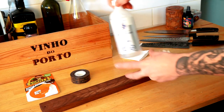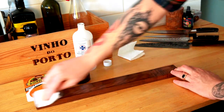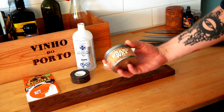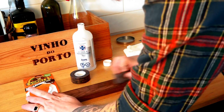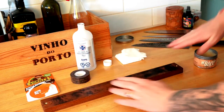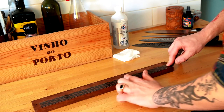For starters, get a bit of isopropyl alcohol on the back of a paper towel and clean off the back of your knife magnet very thoroughly. You want it very clean so that the tape is sticking to the actual wood and not anything on the surface. You also need to make sure you clean off the tile for the same reason — give it a quick scrub with some soap and water, let it dry thoroughly, and then wipe it down generously with isopropyl alcohol. Give the alcohol an hour or so to dry. In the meantime, you can moisturize the front side of the knife magnet with some Knifeware board wax — just be sure not to moisturize the back side. The first time I installed this, I had slathered my whole knife magnet in board wax. The resulting oil made it very difficult to stick the tape, and some of that oil leached out and made the tape come off the wood. By keeping the back of the magnet really dry, you can secure a more permanent hold onto the wall.